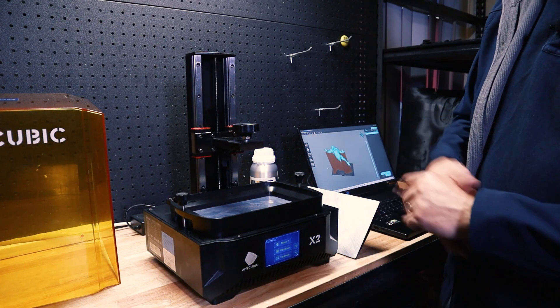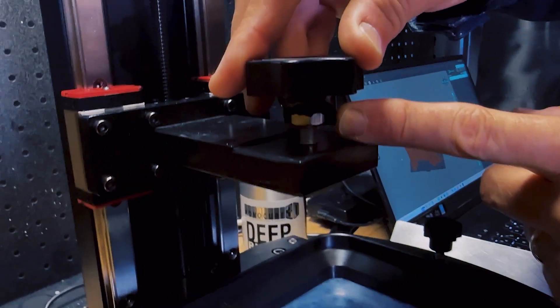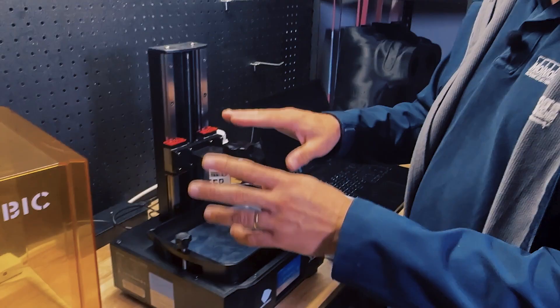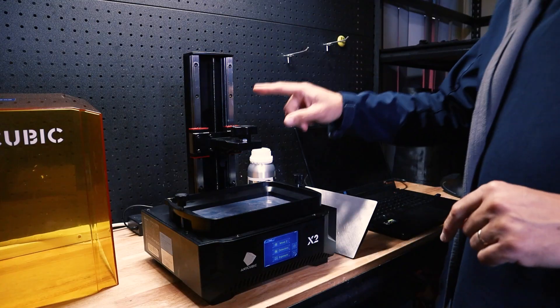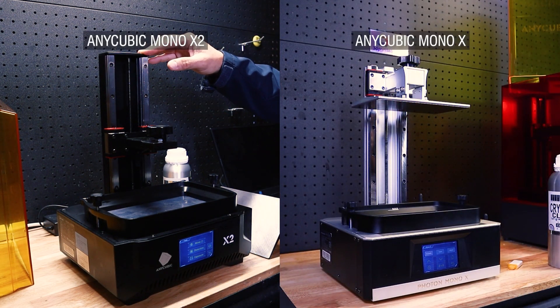The UV power is hard-set to whatever it's set to on this machine. The other annoying thing, which Charlie pointed out during unboxing, is they still use this plastic which falls apart. In fact, if you look closely, you'll see this knob has already started falling apart. That ends up with bits of sharp plastic in the bottom of your vat, which could potentially puncture the FEP sheet. Anycubic, please — you've been told so many times, don't use this plastic for your knobs. All other manufacturers have found the right plastic, so please do your research. Second gripe: they've shrunk the total Z height. The Mono X is about 245 mm; this one only goes to about 200 mm. So you're losing a bit of height, and I've had to shrink down quite a few models that I'd normally fit on the Mono X.